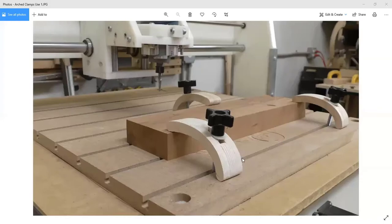In the book, I show you two different types of clamps that I use. Now, with big industrial machines, you often have vacuum as well. When you're working with small parts, vacuum holding is awesome, but it really is completely dependent on the square inches involved in your part, because you're vacuuming the air out from under. Your air pressure is literally 14 pounds per square inch, or in the case of a vacuum system on a CNC, I estimate about 10 pounds per square inch. So the more square inches, like a cabinet side, the better it holds, but smaller pieces don't like to hold by vacuum.